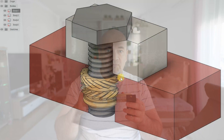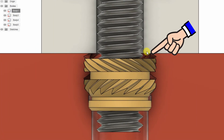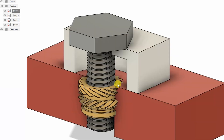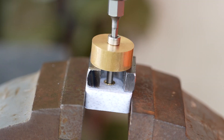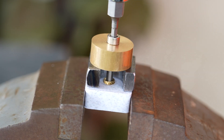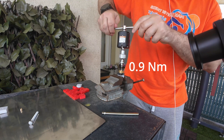I measured this. The second type of load is where we have some gap distance between the aligning object and the brass inserts — either the brass insert is deeper in the hole or the object above it has some gap from the aligning surface. In that case the torque will result in pulling out the brass insert, and that torque is not too big, so we have to pay attention to how much torque we apply, because very easily we can pull out that brass insert.